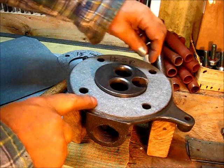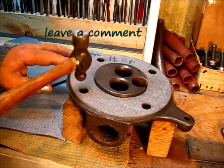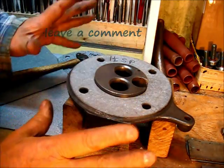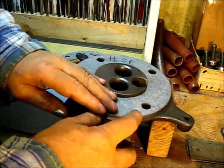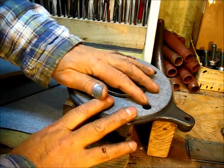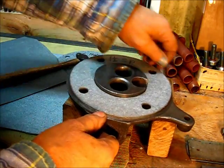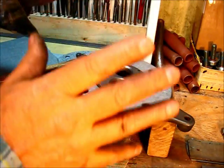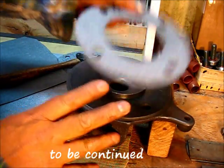The holes are a perfect fit because they were made with a ball-peen hammer on the head, so they have to fit well. I leave the gasket proud all the way around. Once I get it bolted up and tightened down, I take a sharp blade and go around and trim it to fit — that way I've got a hundred percent coverage.